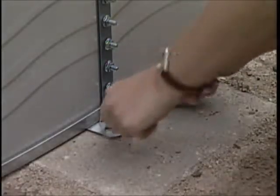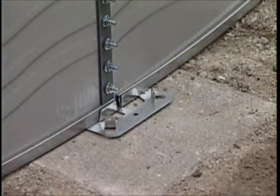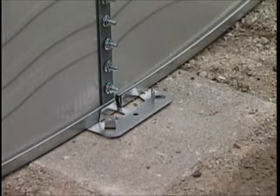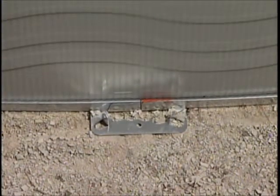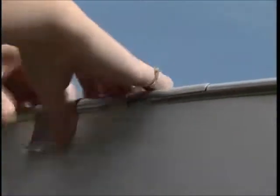Now recheck each base plate. It must be centered on a patio stone or limestone pad, and the base rails should meet in the center of this plate and be about 1/2 inch or 13 millimeters apart. Recheck the slotted tubes to ensure they are about 1/2 inch or 13 millimeters apart and are joined with a slotted tube connector centered over a base plate. You can ensure they stay in place by taping the connectors and tubes to the pool wall with a short length of duct tape.